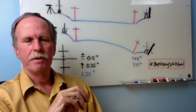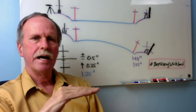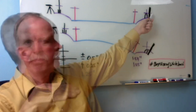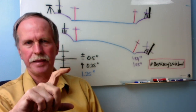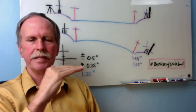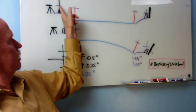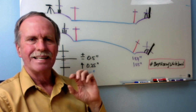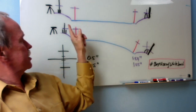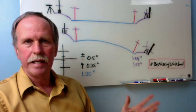Next to that light pole there is a small cable box that is easily visible from my backyard. I took the height of that cable box and put a mark on the light pole. I then measured between my reference mark and that mark, which allowed me to get the exact elevation above lake level of the top of that cable box. I came back to the house and made a mark on my flagpole exactly the same distance above the lake. Now I have two reference marks on either side of the lake relative to the water level so I can make a measurement.